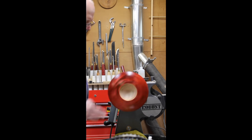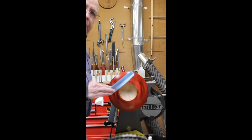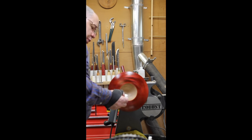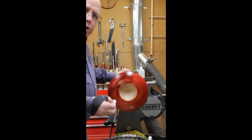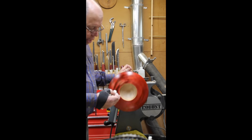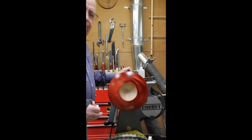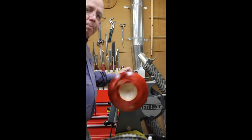I'm still working on putting on my 20 to 25 coats of CA. I've had to change from the blue Scott shop towel to this Brawny industrial white towel that my brother-in-law gave me — he uses it when spray painting tractors. It doesn't produce as much lint. What happens with the Scott sometimes is it becomes so saturated that it starts pulling apart on the turning. Then you've got to let that dry, sand it back to get rid of all the fiber. It's just a real hassle. I'm trying this and so far so good.